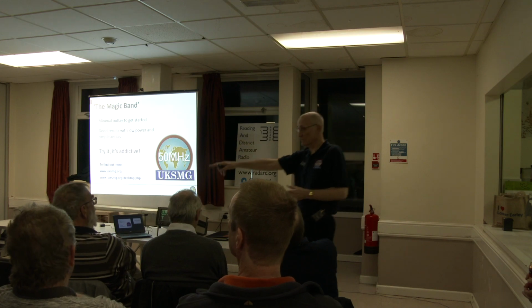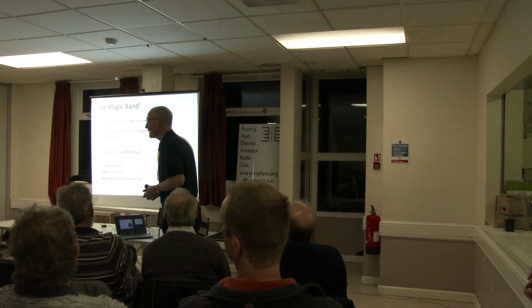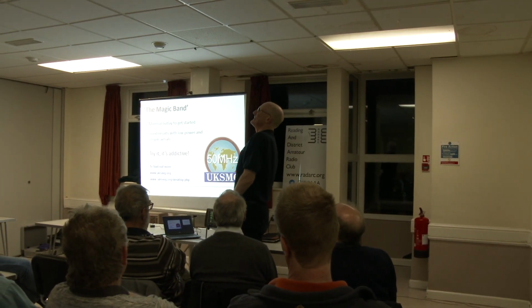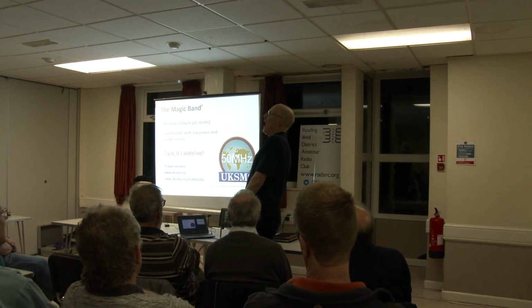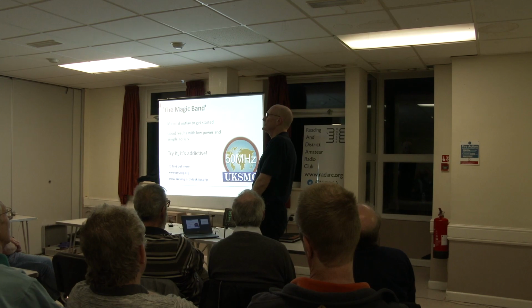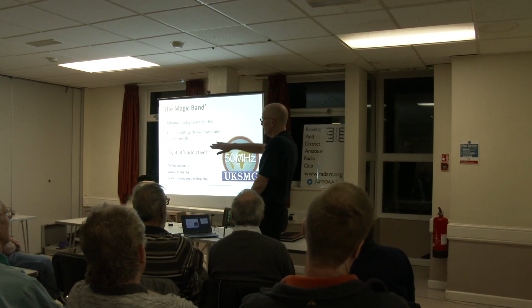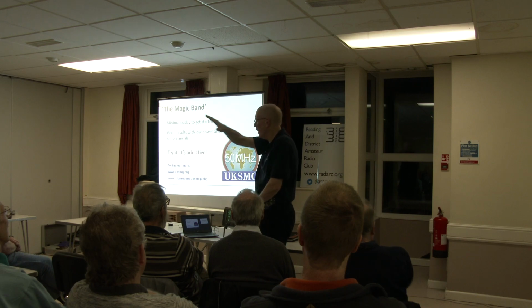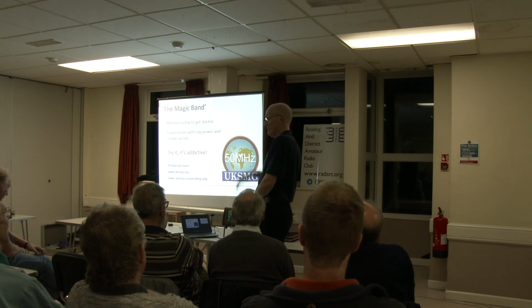I know 28 megs is a wide band, but do you ever get it that the bottom part is quite lively and the top half is dead? Well, 28 is true, but also 6. Some people will tell you that you can actually sort of see the MUF creep up. I think you've got to be quite quick to see it go. I think with F2, it's more pronounced, would be my estimation.